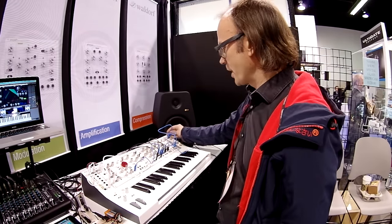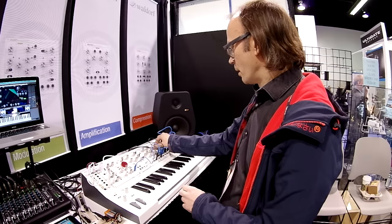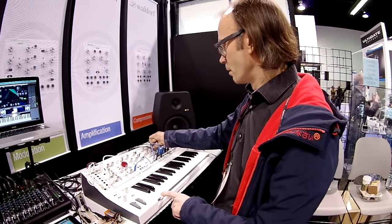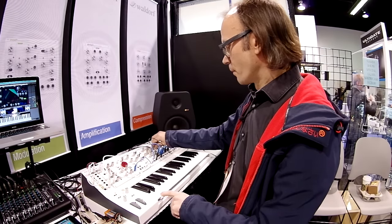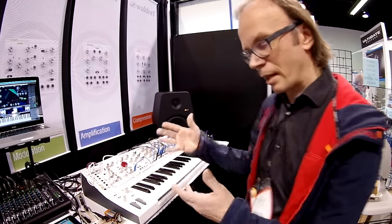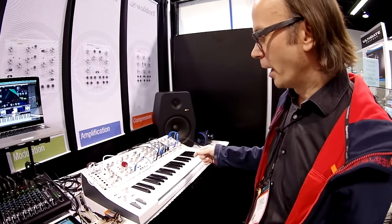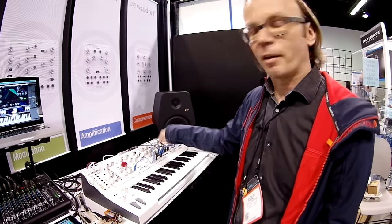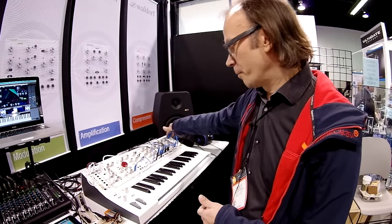And if you do this on the second channel as well, and no, that was the wrong one, and detune the cutoff a little bit, you get some nice stereo effects very easily, because the timing of the cutoff on the envelope is a little bit different on each channel. You can also reverse link the two VCAs to get some auto panning effect if I would patch in now an LFO there. And with the two stereo outputs, it's very easy to do stuff like this.